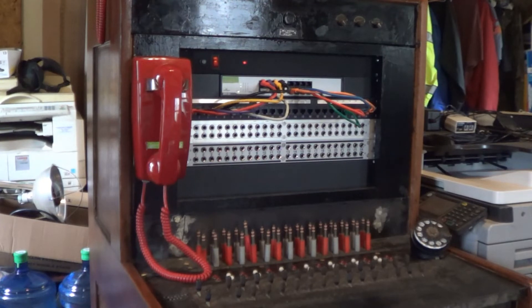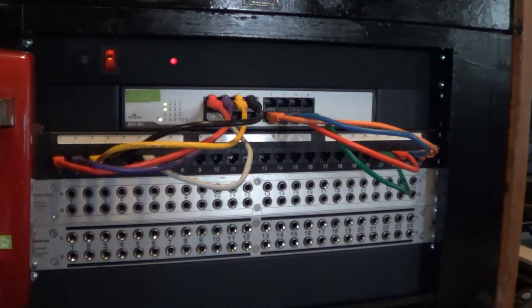We are able to place calls through the board. At the top of the panel you can see the ethernet switch that manages my network connections. Directly below that is a category 5e patch panel, allowing me to hook my various computers and other network devices into the switch. Below that are two audio patch panels that have been rewired for telephone use, wiring the tip and ring of each jack to a standard RJ11 telephone jack. At present I have one central office line through my local telephone carrier, a second voice over IP line for outgoing calls, and a total of 7 working cord circuits. I also have a simplified ring-down circuit and a couple of DC loops for testing purposes.